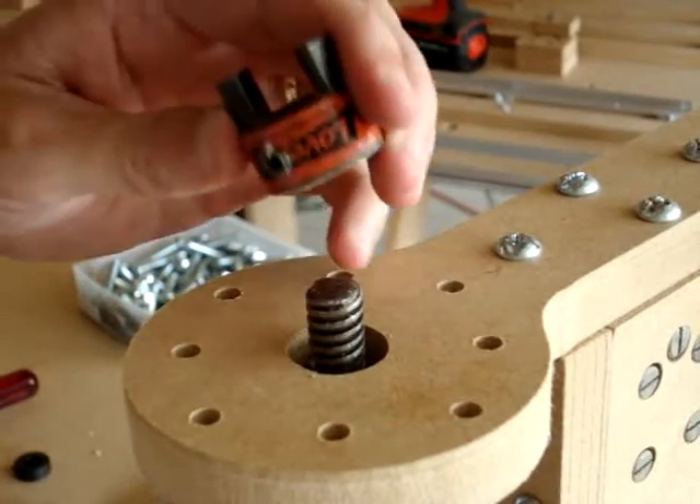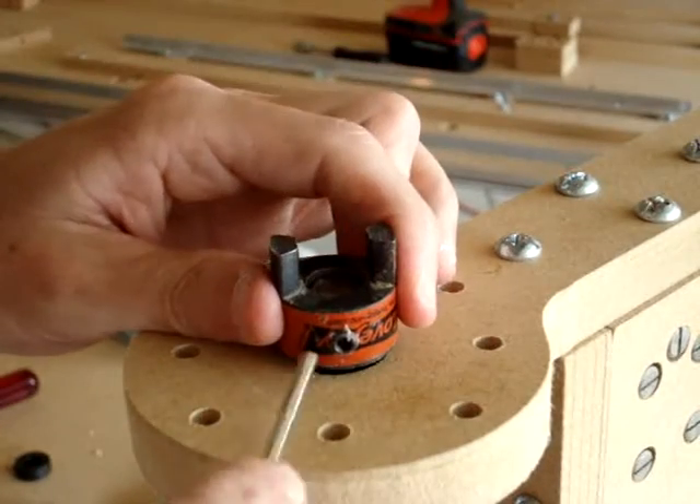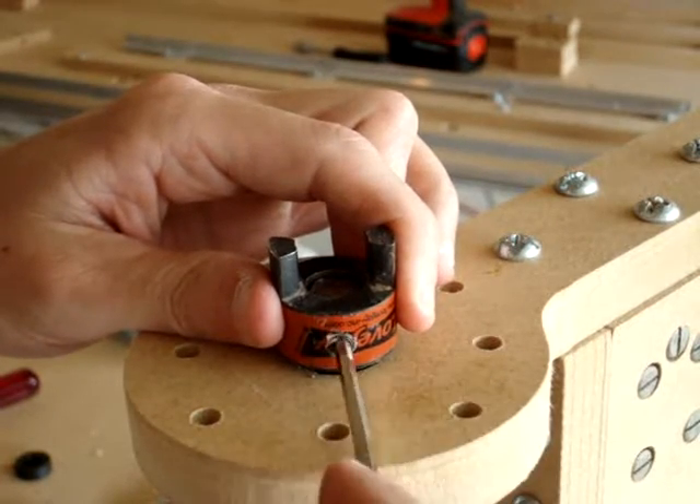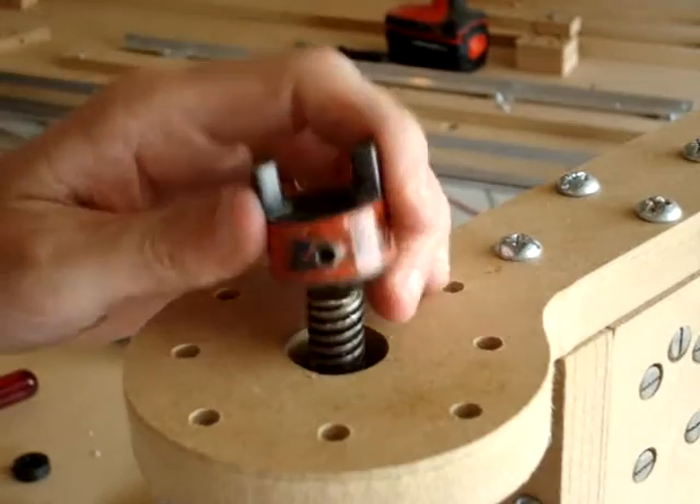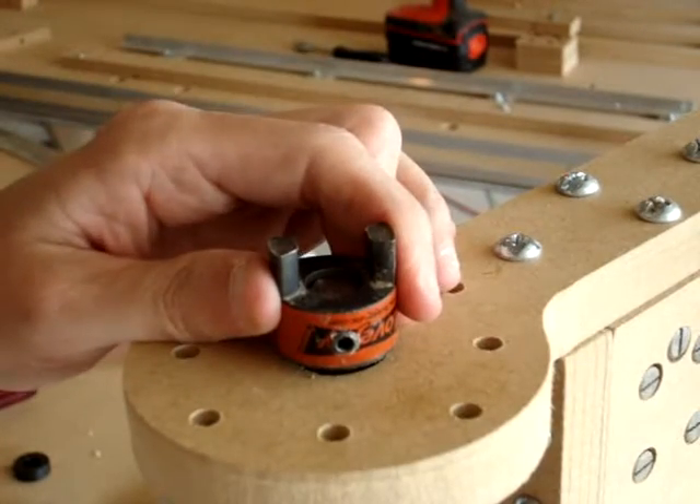Now to add the coupling. This is the half-inch end, and there's a set screw here. Once you have it in place, screw on the set screw. Make sure that when you cut this lead screw, it cuts to about this length once it's already put in place.